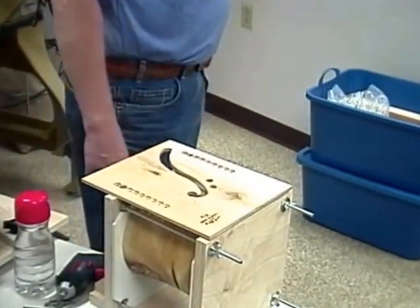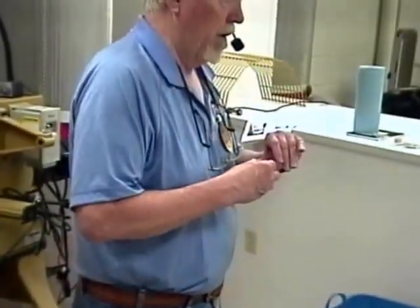I take a plunge router. You can use a straight router, a fixed base that you just adjust down. I like a plunge because you're doing really tiny increments down, and the plunge is just a little faster to me. But what I use is a spiral upcut bit, a quarter inch spiral upcut bit that's running inside a 5/16 bushing. And for those of you that have routers and are into router woodworking, the bushing set that I use is a standard that Porter Cable developed many years ago. I happen to have DeWalt routers, so my Porter Cable bushings fit perfectly in them.